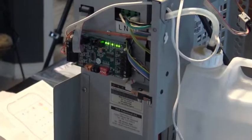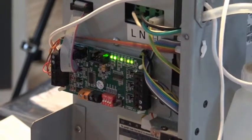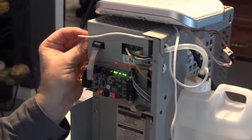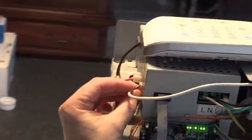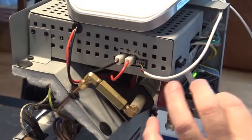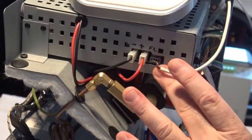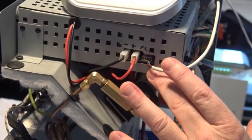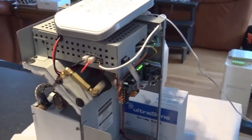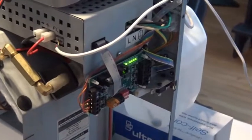Now go through system ready, system okay, and fluid status. Once the fluid sensor is installed, make sure the low voltage cable is plugged into the machine — beside the positive and negative where you plug in the batteries. To reset the counter for fluid, disconnect and reconnect this cable once the machine is powered up, and that resets everything. What you're looking for is six green lights, which indicates the smoke cloak is ready to work. It's now connected, functioning on its own, independently, properly.